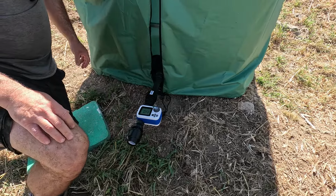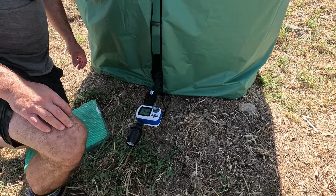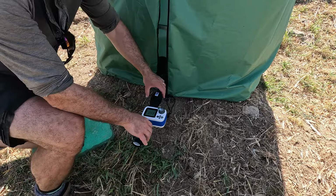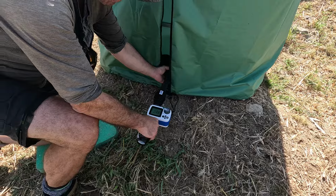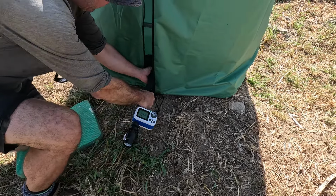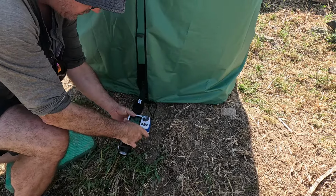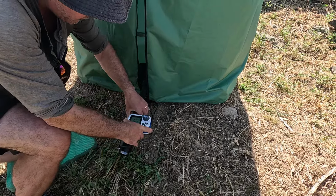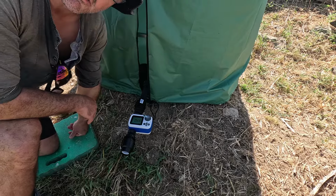The only other thing I can get you is some gas pliers to tighten it fully. But a few drips for the 10 minutes we're going to have it on isn't going to be a problem. I know, but you can't have it on auto then. Why? Because you have to have the tap fully on for the automator to actually know when to turn it on and turn it off, and it'll just be constantly leaking in between.